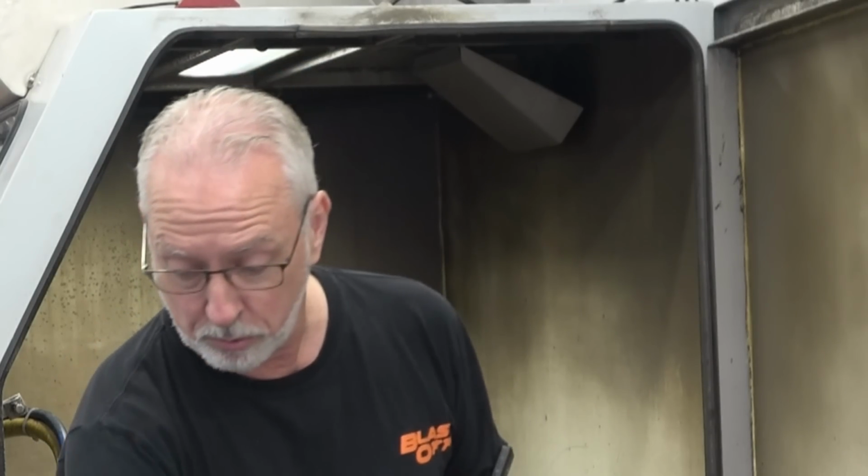And we use two. We've got a ceramic, which is quite hard, gives a matte finish, but we use a very fine glass bead, which particularly for aluminium parts gives a nice shiny smooth finish, which we find is very desirable, particularly in the restoration business where people are looking for a nice factory finish to their engine parts. So that's what we use predominantly, the glass mixed with the water, and it's backed up with a bit of compressed air, so the harder bits we can clean a bit easier. Pretty much that's all there is to it, water and glass bead.